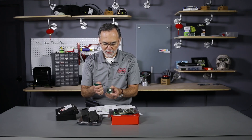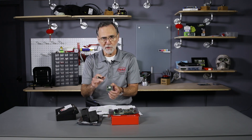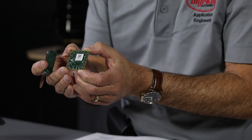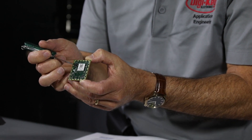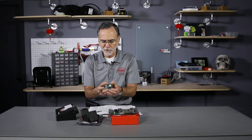By going to a board like this, what you're able to do is make your product simpler — a simpler circuit board — because you can hand-solder this down to your other board and end up with a complete computer system. All of the transmission line effects and all of this high-speed stuff at 500 megahertz is being taken care of by Microchip, so that makes it real nice.